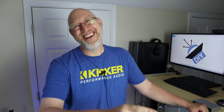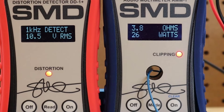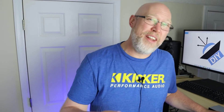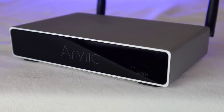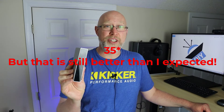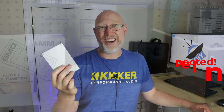Bam! 26 watts into a 4 ohm load. Now you'll notice it's actually reading a 3.8 ohm load, which is really interesting. I was really worried about letting the magic smoke out of this nice little amplifier, but it held up just fine. I'm going to give that a thumbs up to Arlick for building a nice durable machine that can handle this amp dyno test. And of course it didn't make the rated 30 watts, but that's okay because no amplifier like this ever does. Getting 26 out of 30 is actually pretty good for this particular market.